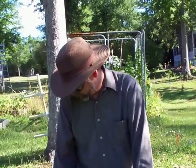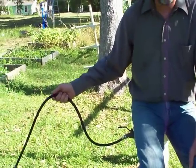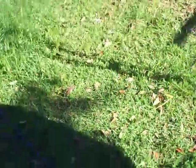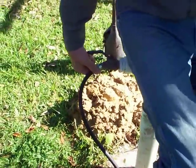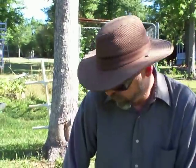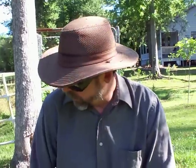I've got that two-inch rig that we made the other day. Something I forgot to mention when putting it together — if you notice there's a little black hose in here, you're going to have to get one of these. This is a washing machine hose, and the reason you need it is because it has a female end on both ends to hook to a washing machine. Since we're using a regular spigot faucet, we're going to have to have a female hose end. We can't use a regular hose because a regular garden hose is female on one end to hook to your faucet and male on the other end. This just makes it so you can hook a standard garden hose to a faucet on both ends.